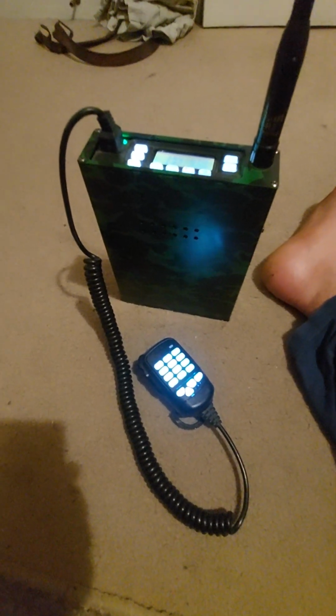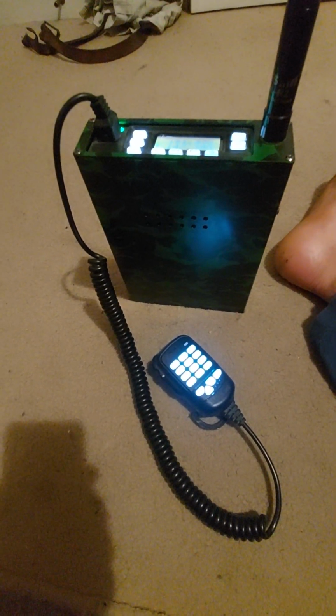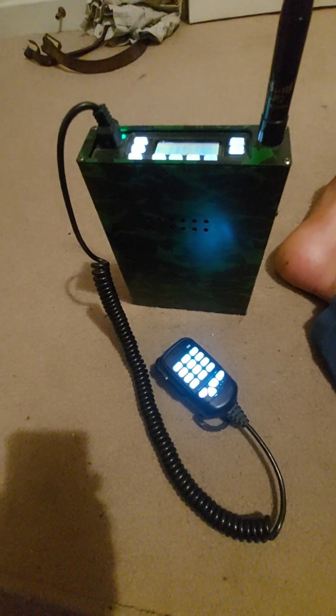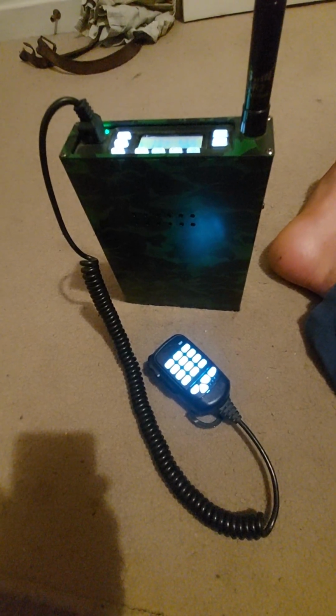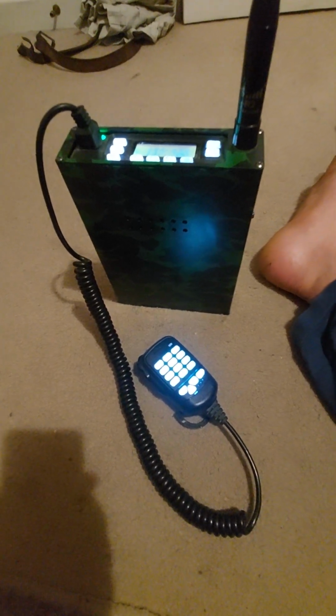Sloper antennas, well, you know, the low end of the sloper is where you're going to get the signals coming in from. So if that antenna box, that balun is mounted at, let's say, 4 feet, and it slopes up, and it goes up, let's say, 60, 80, 100 feet or so, in the direction of the low end of the antenna, that's the direction you're going to receive signals, just like a standard sloper looks like an 80-meter dipole that's sloped down. That's exactly how you're going to receive those signals.